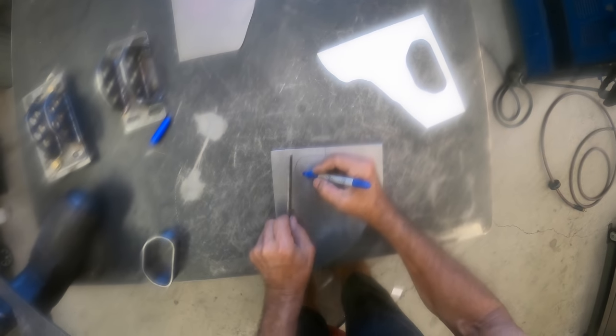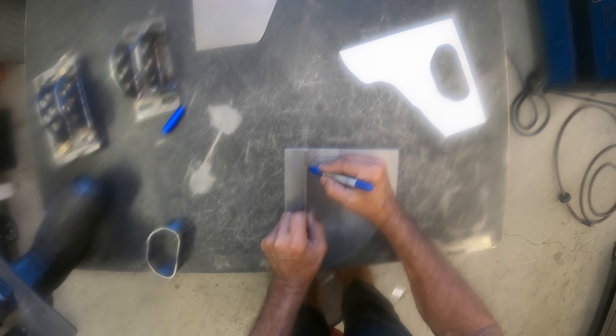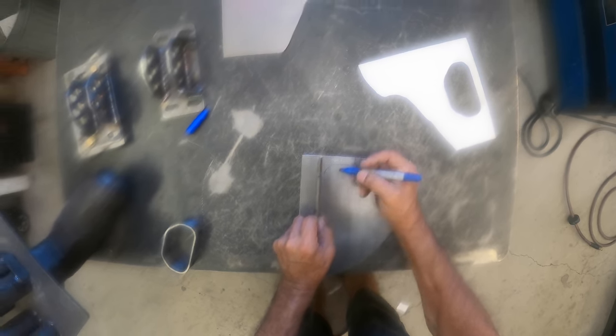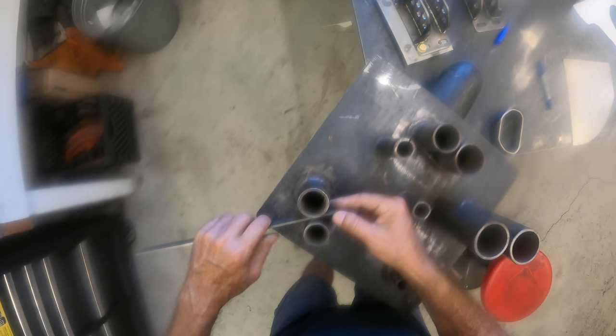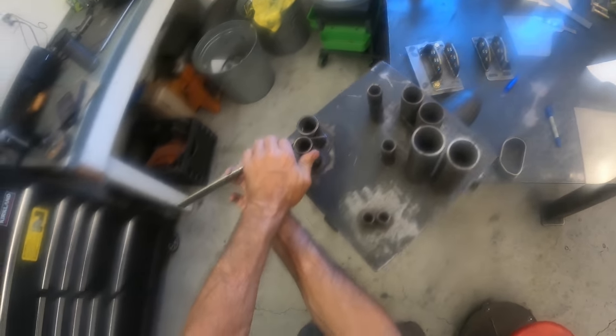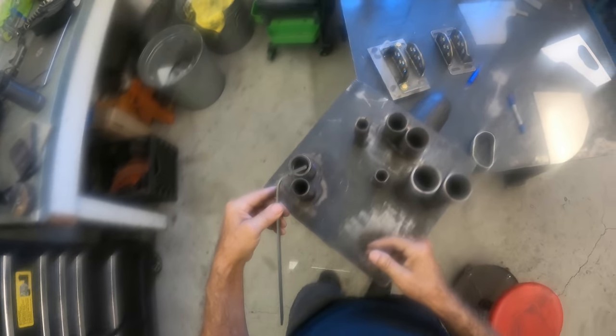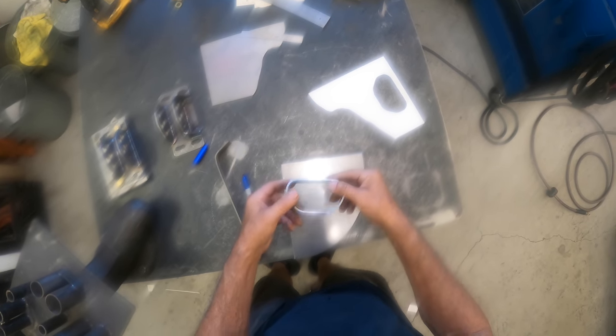Usually you got to start the bend quite a bit early, like 3/8 of an inch early before the bend, and you mark it on the top, and then put it in the center, make sure it's square this way, and just simply pull it around and get it the right shape, and eventually it works out that it comes like this. And then you weld the seams together.